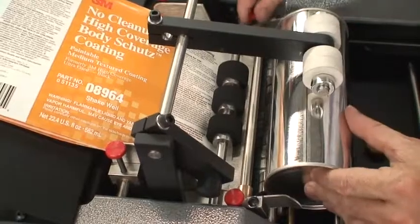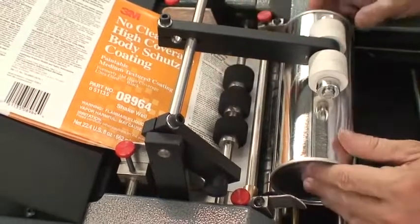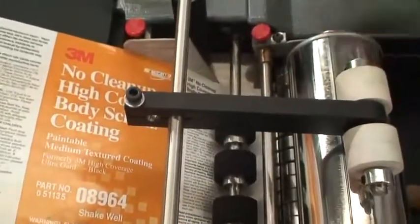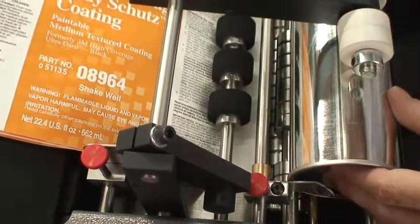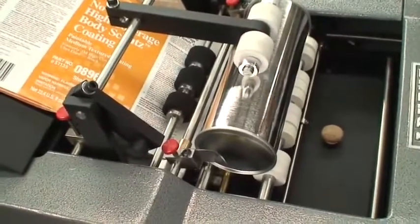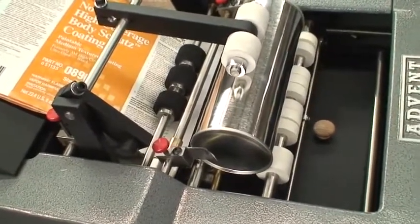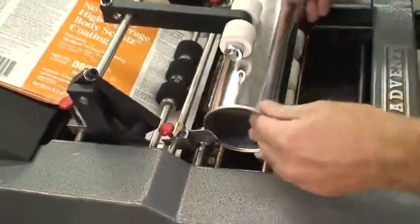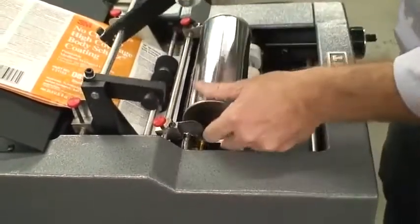Lift up the overhead pressure arm and get things kind of sided — bring a label down and side it. Now I need to make some final adjustments. First thing I'm going to do is open up my carriage, because I'm doing a different diameter. You can see it's just turning this knob — you can go anywhere from 1 inch to 12 inches in diameter. You just want it supported by both sets of rollers and not touching the finger bar.